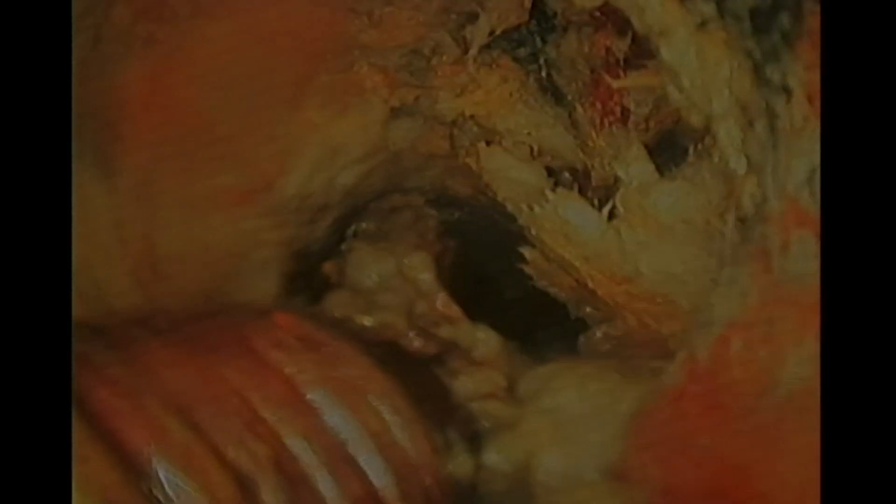All this paper and solids are blocking up and not going anywhere. We're also looking at an inch-and-a-quarter sewer auger by Electric Eel brand, operated by hand about 25 feet straight into the line through a basement cleanout. Fortunately, if this were through a vertical cleanout out in the yard, it would have been a bigger struggle controlling how I turned and pulled my cable.